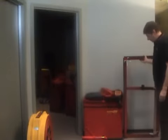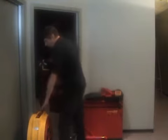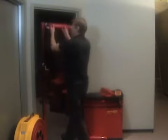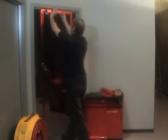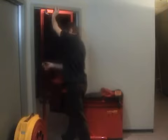The next step, and there's different ways of doing this, but the way I do it is I take the frame and I fit it into the doorway first, so I get it up to the right size. So we can get the height first, or the width, it doesn't really matter. Loosen off all these knobs. Take it just up to the top there, but without very much pressure on it, because we're going to have to get it back into the doorway later. Tighten these two up, just finger tight.